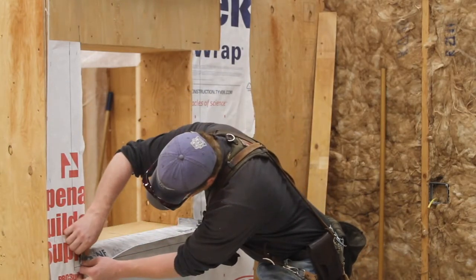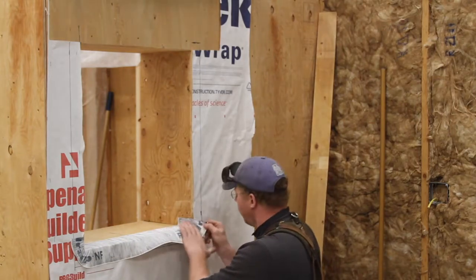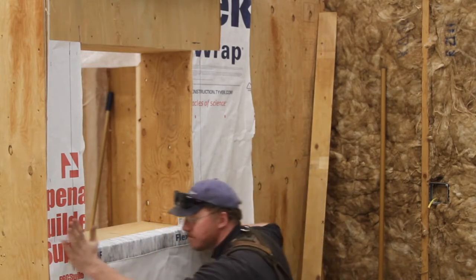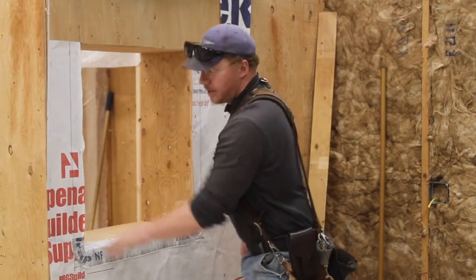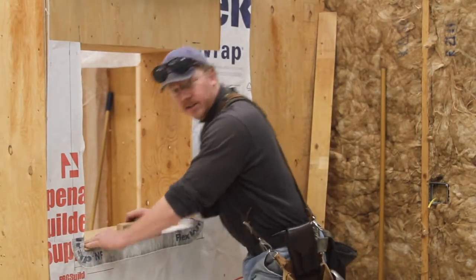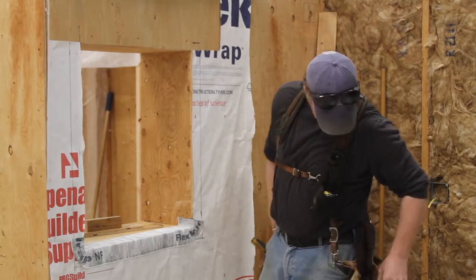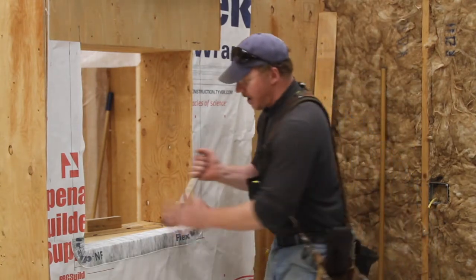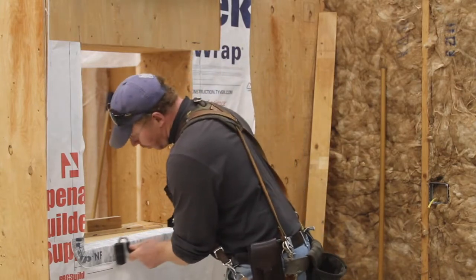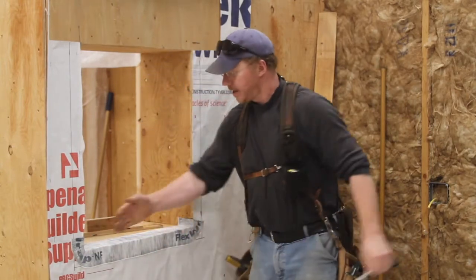Now that the sill is down, it's sometimes nice to have a block of wood to make the corner nice and crisp and give you good pressure bonding in the corner. Using a J roller, you're not going to get quite into the corner, and the corner is a place where we want really good adhesion. The J roller reaches everything else pretty easily.